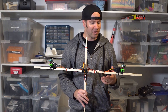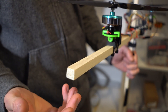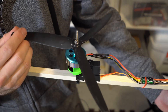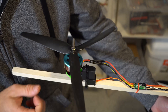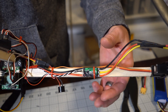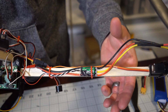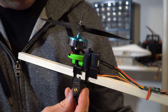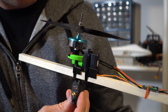The flying part of the Dementor consists of these main components. I'm using just square wooden dowels because they're cheap, they're easy to source, and they're really easy to work with. The next part are the motors and propellers — these are just like what you'd see in an RC airplane, there's nothing real special about them. Next you have the ESCs or the electronic speed controllers, and these are the same type that you'd see in a racing drone. We need that high performance to get it more stable in flight.